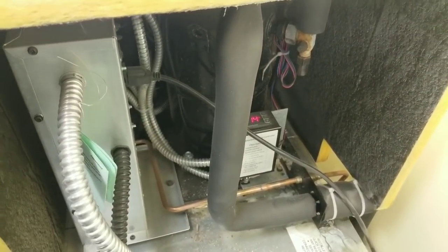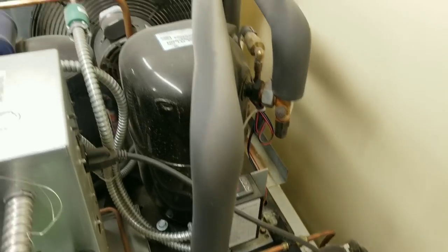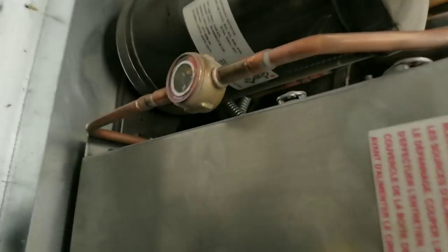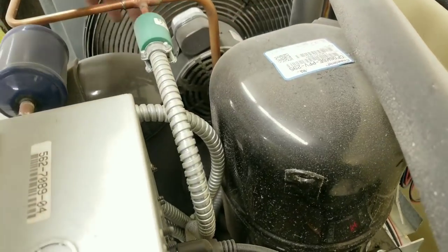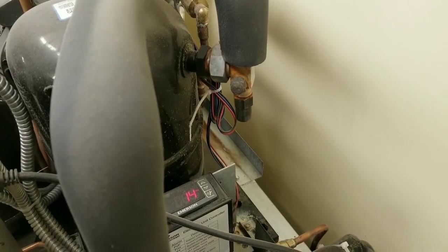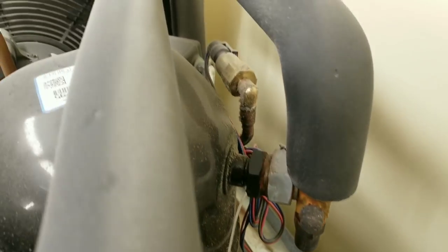All right, so what you're looking at is the condensing unit of the freezer we're working on. Just gonna tip this up real quick. It's a little dirty. Sight glass is clear. Condensing fan motors doing a pretty good job. Everything's dusty though. I'd really like to take some nitrogen and just blow this thing completely out. Rotolock looks rusty. Not a big fan of those rotolock connections.